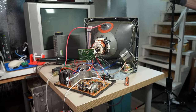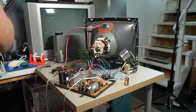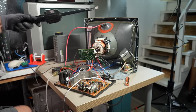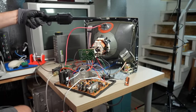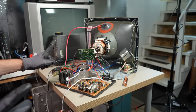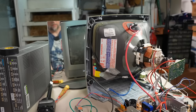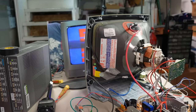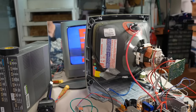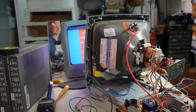I can't say I'm not a little nervous for the first power-on. I'm wearing gloves and safety goggles just in case, and there's a fire extinguisher off camera. Here we go — power applied! The TV just turned itself on. I had the screen control turned all the way down, but we're getting 20,000 volts on the high voltage — basically the same as with the original board. The power LED is lit on the remote board. Let me grab a mirror to see the front screen.